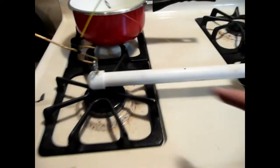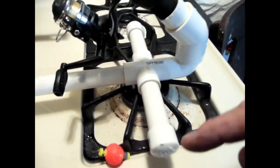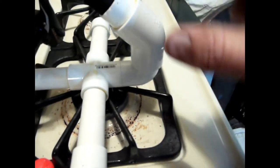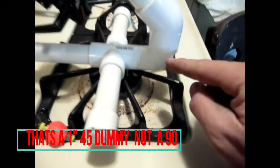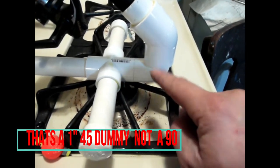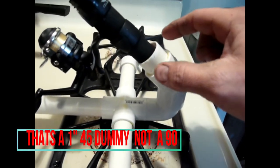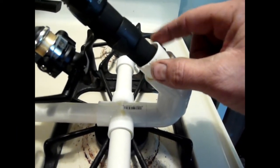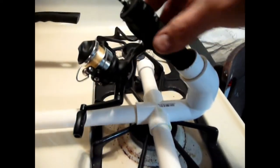This is all three-quarter PVC. That's a cap, coming back to a four-way, three-quarter, with caps. This is a three-quarter 90-degree T with one-inch 90, glued to the three-quarter 90. And then inside that is the lighter gauge — I guess it's schedule 20 — and a one-inch that accepts the rods perfect for the handle.